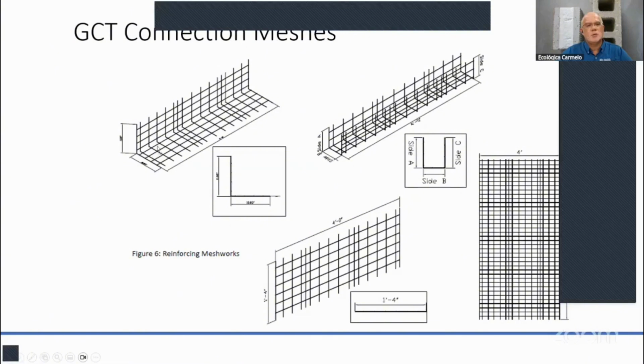And that's what's connecting the panels in those corners, right? Or if it's a slab and the wall, you'll also be using these meshes that will probably be 7 inch by 7 inch, right, on these angles. And if it's an exterior wall, in the joint between those walls that are joining, that mesh will be, let's say, about a foot, 12 inches, and then the other side will be like 7 inches. So that's where we use the long L mesh.